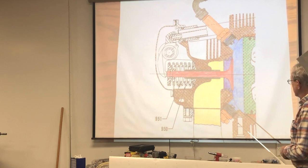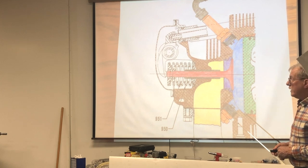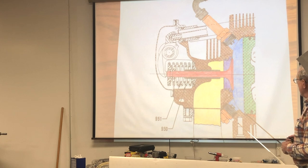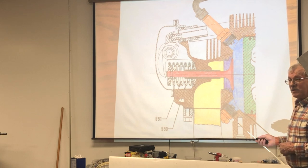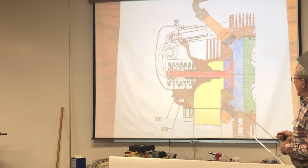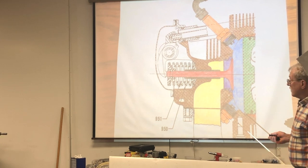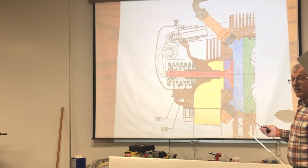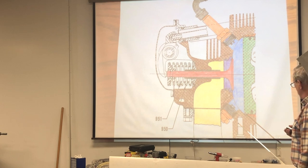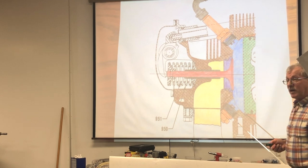And a lot of research was done on how to reduce the amount of lead buildup in the lower spark plug. They found out that the reason that the lead becomes chunky and melts down into the spark plugs is because when you advance the throttle from idle to takeoff power, you'll all of a sudden create a lot of heat in the combustion chamber. And what it does is it actually reaches the melting point of the lead, and the lead will melt itself right down in here into the spark plug. And it'll keep on building up until it'll actually short out the electrodes.